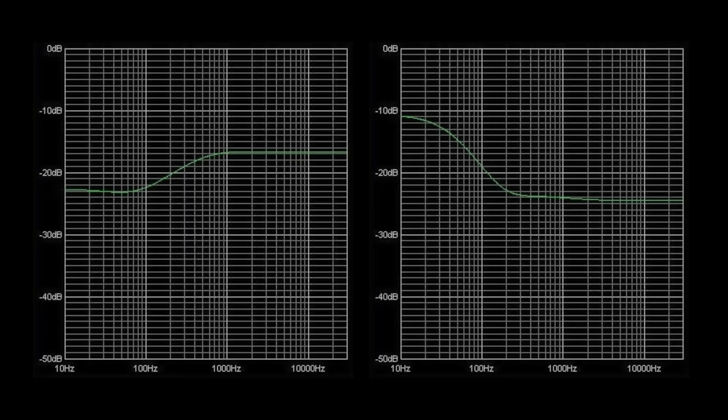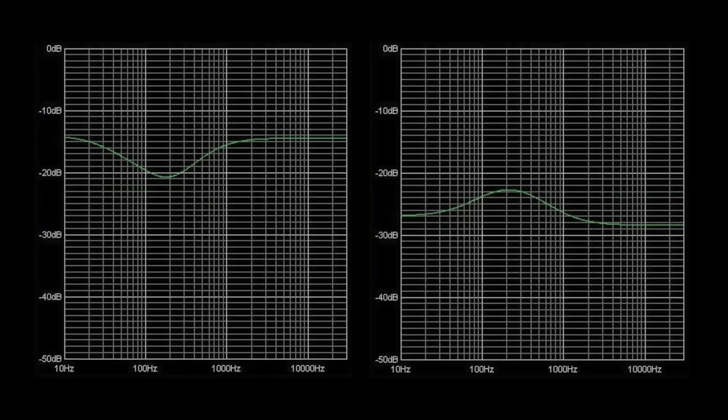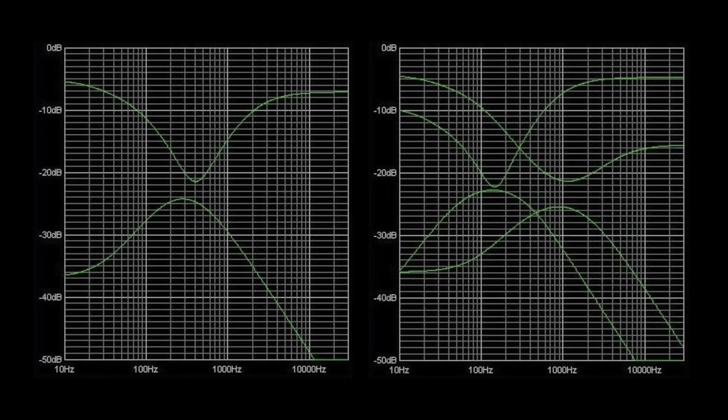Note that this is a shelving style EQ where the midpoint remains fairly steady around negative 22 dB. In Ampeg's version, that midpoint is about 300 Hz. Here are the treble and bass cuts both at around 25% or 9 o'clock. Look what happens when you boost both bass and treble, or conversely when you cut them — this ability to scoop or boost the midrange is another great advantage of the James. These are gentle plus or minus 25% settings. Ampeg's preamp stages have a good amount of clean gain, allowing you to recover gain loss to the tone stack. With this in mind, a dedicated mid control is largely superfluous.